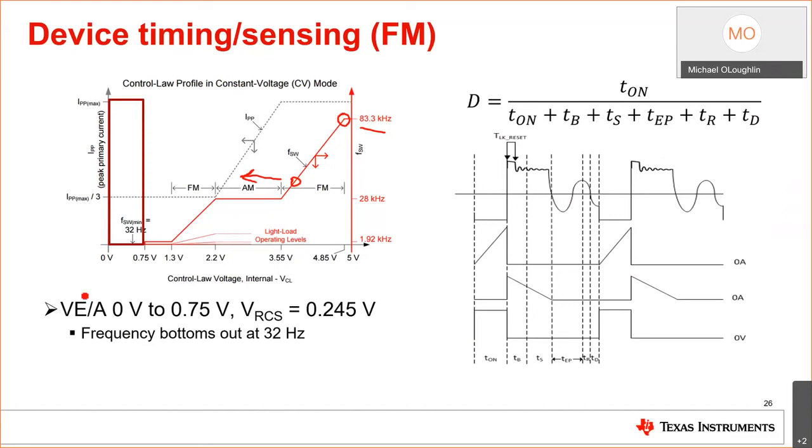Okay, and there was another question that came in earlier about what is a maximum or peak voltage the wake-up IC can accept from a flyback winding? I answered with the range, but did you want to go into that more? Yeah, that's 200 volts. That's based on the reflected voltage plus the output voltage needs to be less than 200 volts. So that depends on your transformer turns ratio. It's not just the input, it's your output voltage and a transformer turns ratio. Your 200 volts is your limit. And how you size within that limit has to do with your input voltage and the transformer turns ratio.